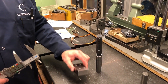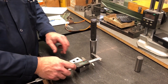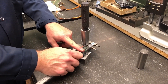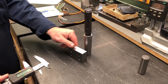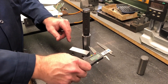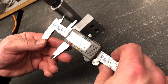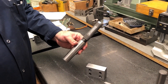I have this 1-2-3 block here. I set it down. What I'm going to do is set the back side of my digital caliper flat down, move it across here, zero my dial out. Move to the two-inch section, get just the right feel, come across here — basically fifty-two thou. A number four Morse taper tapers fifty-two thou per inch. So it is possible to measure a Morse taper with a digital dial caliper or any type of caliper.